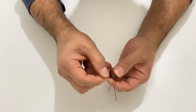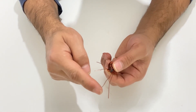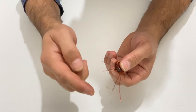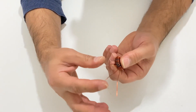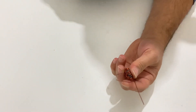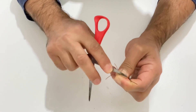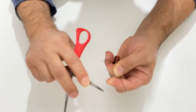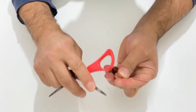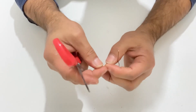At this point it's very important, please watch carefully. As you see, these pins are marked — this one is a black one, and this one is also a black one; this one is white and this one is white. So I will connect the black one with the white one — these two cables I will connect together. I'll scrape the insulation from the cable. If you make wrong connections your circuit won't work, and you will be very frustrated, so be careful at this point.